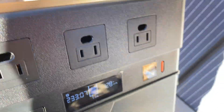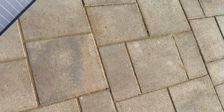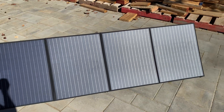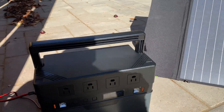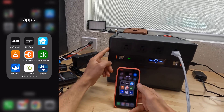We're getting 130 watts unshaded, and with two sections shaded we're still getting 90 watts — which is great to see. So for individual small solar panels, even if two or three panels are shaded you'll still get output from the remaining ones. Now let's review the application for this power station.